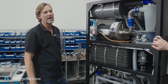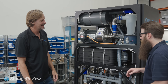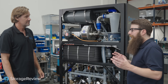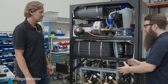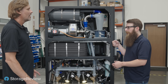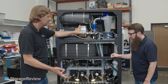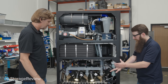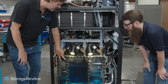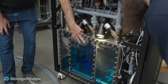However your facility is doing heat rejection — chilled water, evaporative cooler, or some other method — this is the cold water out and that's the warm water return. So that demystifies it: you can see all the 3D diagrams, but if you just follow the tubes and understand that the vacuum is doing the work — vacuum is the key. This pump creates the vacuum for the whole system, pulling the fluid through. We have high vacuum on the auxiliary and main chamber, and maintain a low vacuum on the reservoir.